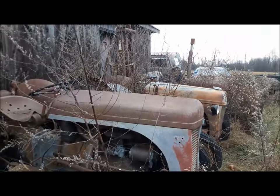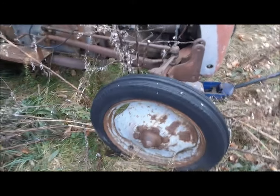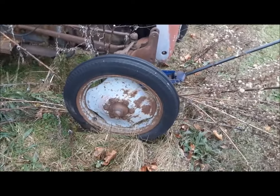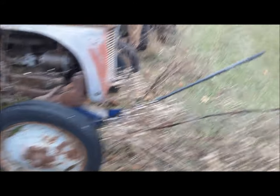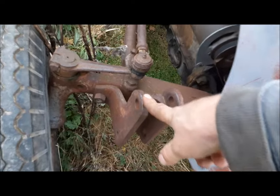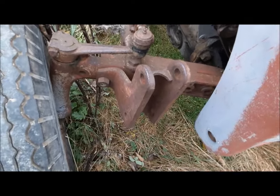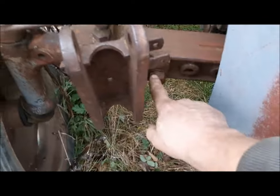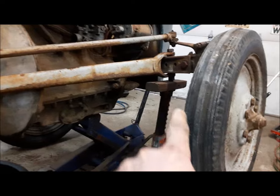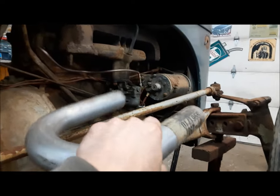Here we are in my personal backyard junkyard. We've got this old Ferguson here that's got a tire — it's a perfect match with the scallops on it and the right tread pattern. So we'll grab that one and worry about matching the other one, because it's got a three-rib on this side. You can see on this one the mounting brackets for a Ferguson manure loader, like I explained. On this one they didn't put the longer bolt — well, they put one longer bolt. Stuff all gets mixed and matched over time. I've got this side up high on an axle stand to get the axle tilted over so the radius rod and drag link are articulated up, so we can make sure when we make our exhaust it's not going to get involved with that.